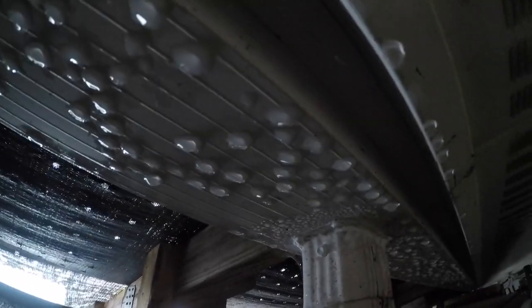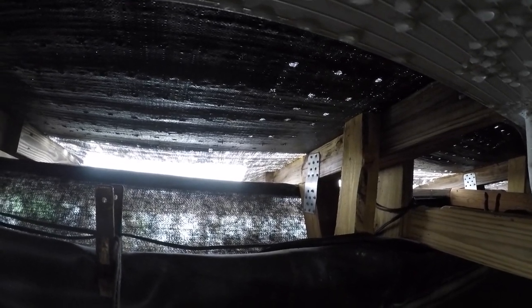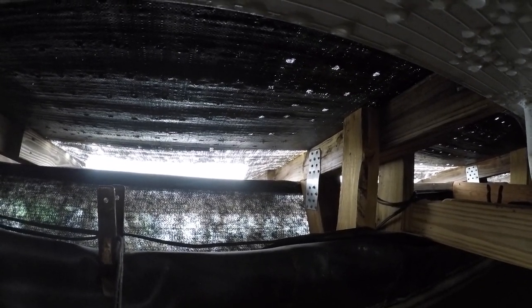I don't know if you'll be able to see, but this is that ninth rafter. Here it meets the super gutter. This is the metal plate, connects the angular 4x4. This 4x4 runs there. And then that metal plate attaches it to the rafter on both sides, like 40 screws, doubled up metal plate, and then the rest of the wood is just for the construction of the aqueduct.